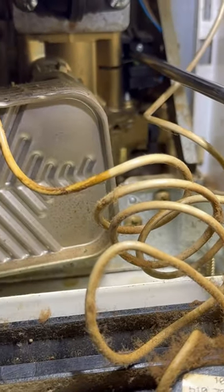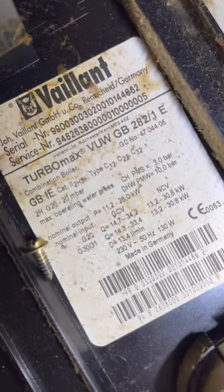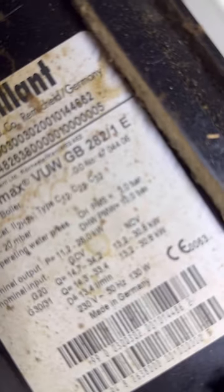As it will get flooded in the comments — don't change the diverter valve, you can get the diaphragm kit. But for now I'm going to put a bit of cardboard in which bridges that gap, getting the customer some hot water until they decide to replace the part or the boiler.